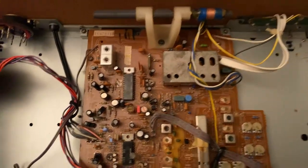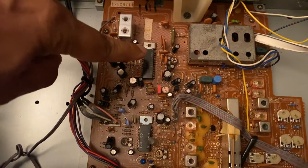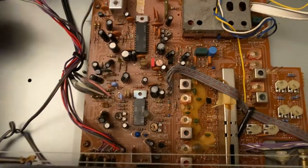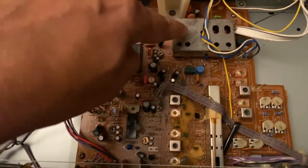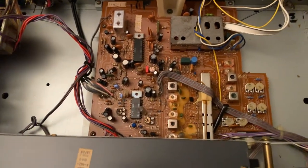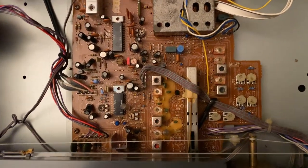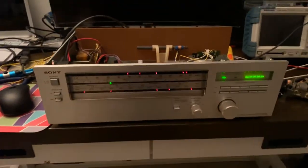There's not a lot of info on these on the web, so take note. This is the main AM/FM processing IC, this is actually the stereo decoding IC, and a few coils — not very much. This is the FM tuner self-contained. I was hoping to get a lot of transistors and coils to strip, but in fact it doesn't even have a tuning capacitor. As you can see, there is no tuning capacitor, and it took me a while to figure out. You can see the cord — it actually goes nowhere apart from the dial.